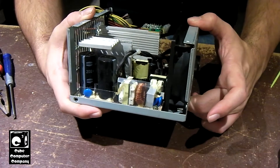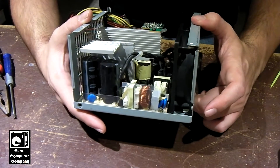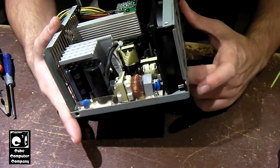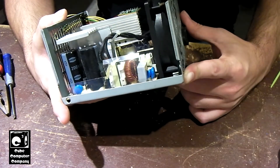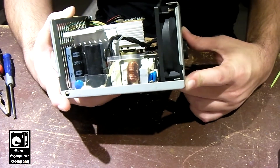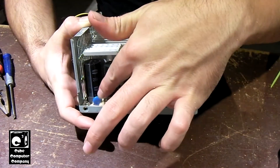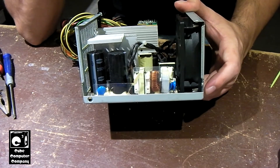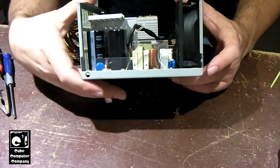In this video I'm just going to be taking the PCB out and having a look at the bottom side, because I don't think I've ever done that before with this unit. One thing I should note about this particular unit is it has that infamous yellow glue in it. But whoever put this unit together did not get overly excessive with the glue, and they kept the glue for the most part off of the high-voltage components. There is some over in this area, but the glue isn't much of an issue unless it's on a component or an area that gets hot, because once the glue gets hot over time it starts to darken and get conductive.